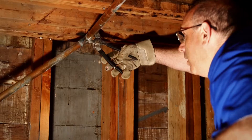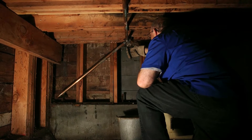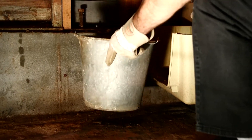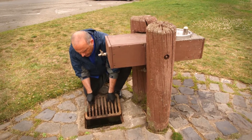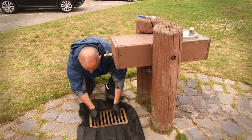Crawl spaces with plumbing can be an issue because these areas are rarely checked. You might have a leak that causes water to collect, which can be the source of mosquitoes for an entire building. The solution is as easy as fixing the leak. Drains and catch basins can also be mosquito breeding grounds — adding weed cloth to a catch basin will eliminate it as a possible location.